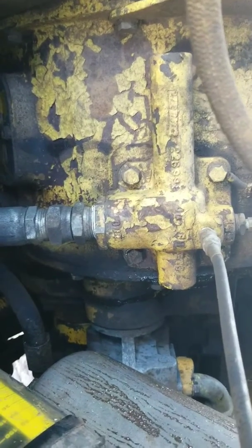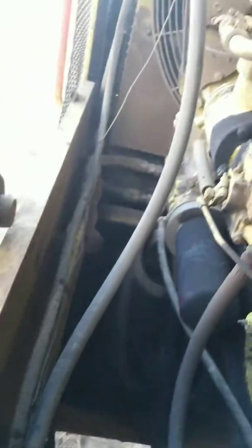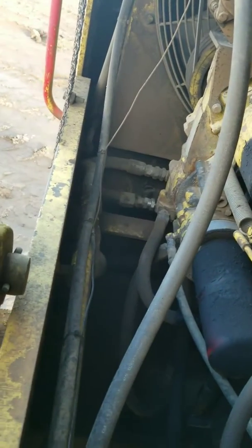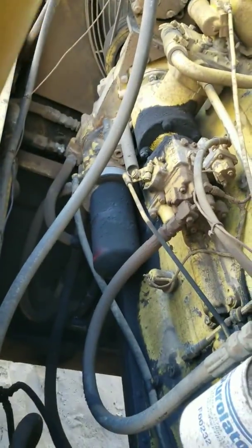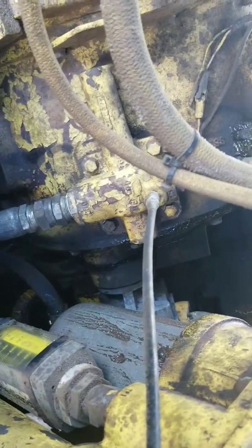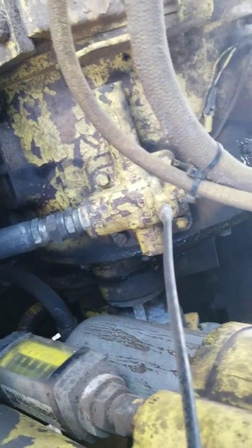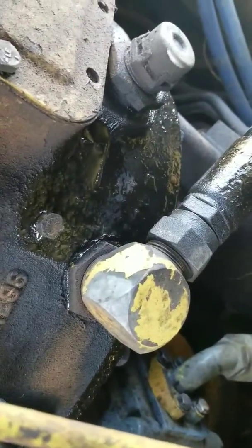What you're looking at here is your torque converter regulator valve. This is your converter out pressure right here — that outlet goes down, runs along the frame, and connects to one of those two lines in the bottom of the radiator, which is your oil cooler for the transmission and hydraulics. You need to install a 0-to-100 gauge here, and I've got this gauge running up into the cab so I can see what's going on.